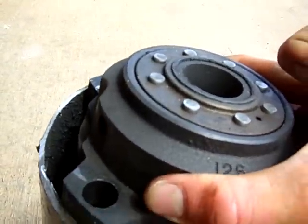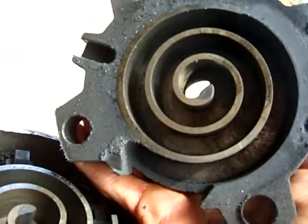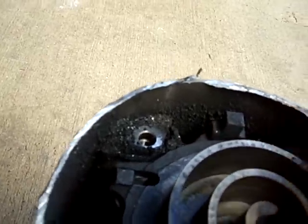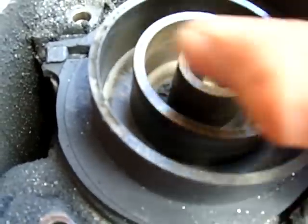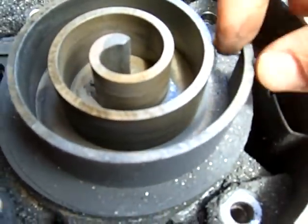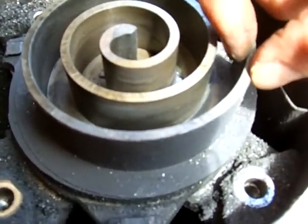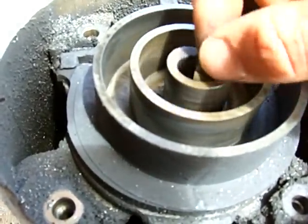I'm going to lift this thing off. There it is — the scroll. Ta-da. So yeah, there is movement. I imagine the movement is side-to-side. And if it's side-to-side, it's going to go around — it's going to come in from this side. The other one looks just like this but goes in the middle between all these. The side-to-side motion is going to squeeze against this rail all the way in and build up pressure all the way to the center where you reach your highest pressure.